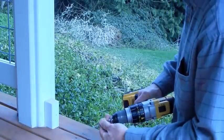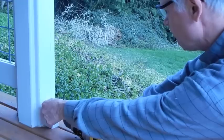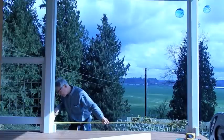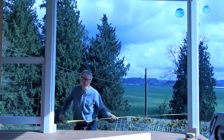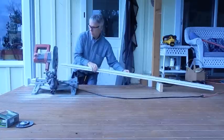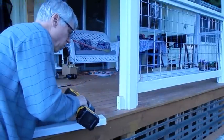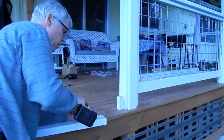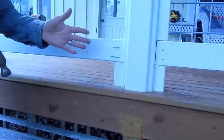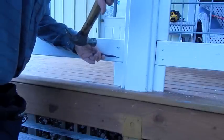Using this 7/32-inch drill bit, sink in your two and a half inch galvanized screw. I've got a line there on the post so I can center all my panels. It looks like we got 76 and a quarter. It's always good to set up your chop saw close by. Now I'm going to do a little pre-drilling, using my 1/8-inch drill bit. I scoot the bore out a little bit because when I nail it's going to push it back in. Take your nail set.